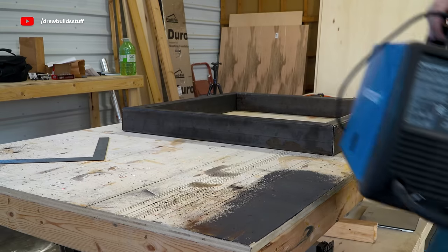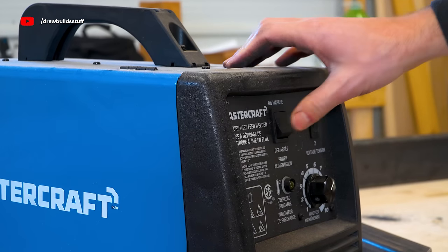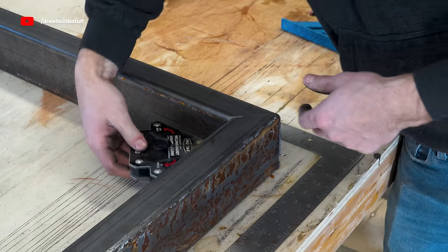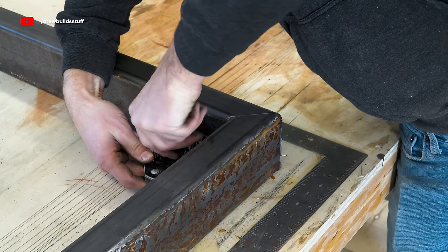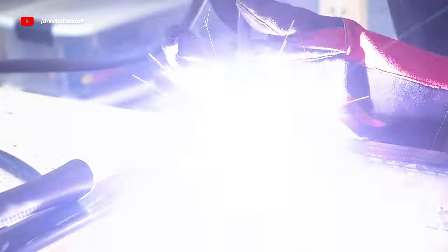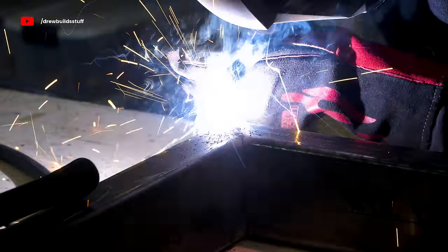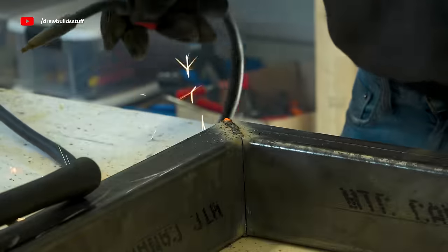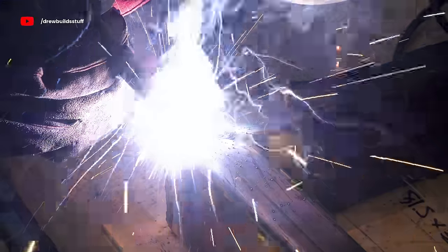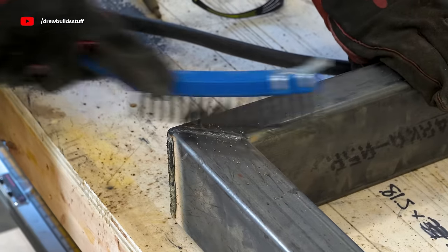With a good rough fit I got out my flux core welder — a really cheap one I got on sale at Canadian Tire that I've been using for years. A lot of people think you need the best tools to build cool stuff, and that's absolutely not true. I used a welding magnet to hold the corner square while I started welding, then went around the frame completing the welds. I'm not the world's prettiest welder but I can weld fairly structurally, and I'm going to grind these down anyway.